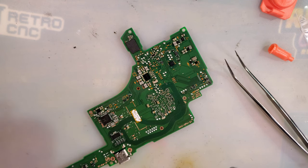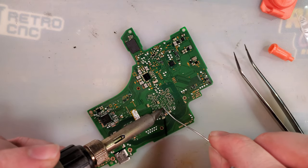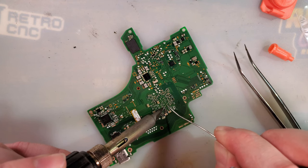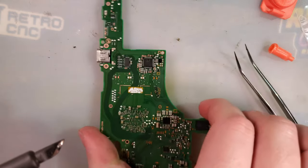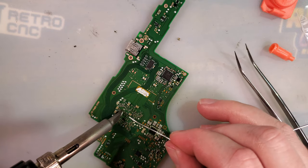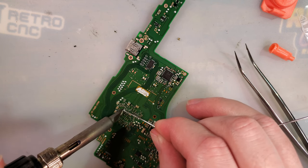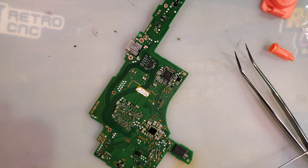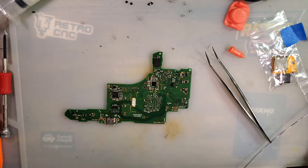All right. It was set to 300, now it is set to 400. It's not flowing very well, but there's more solder on that joint than there was before. Let's get the other one now. And same thing. Cool. So now, I'm gonna turn my iron back down before I forget. Bring that up, and we're gonna solder that with hot air.